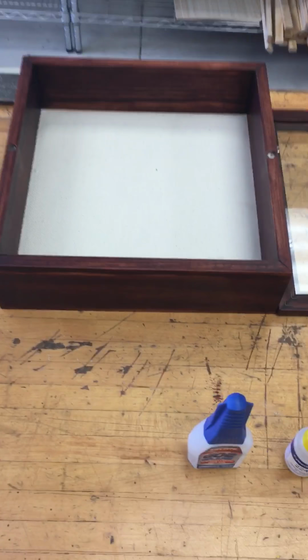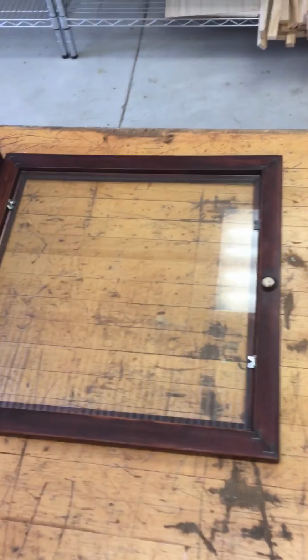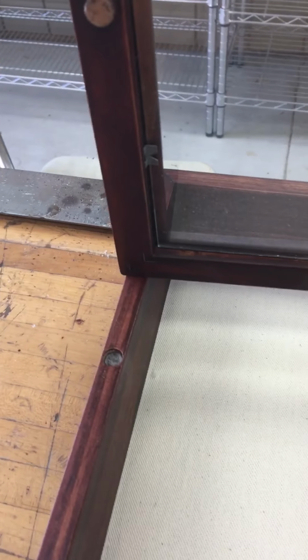So we manufacture shadow boxes for a company in Philadelphia. They order quite a few shadow boxes from us, and we have a design where we actually use high powered N52 magnets. We are one of the highest rated strength cylindrical magnets, and we embed them into the frame and recess them down into the box. So it creates not only a magnetic pull force, but also a dowel effect, so the lid wouldn't slide off for whatever reason.